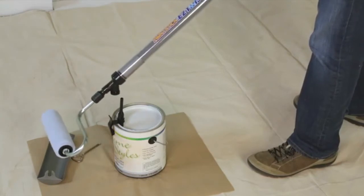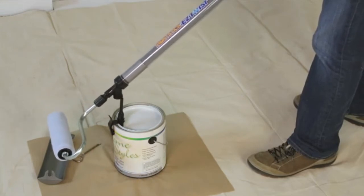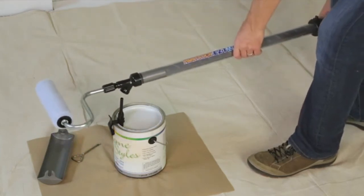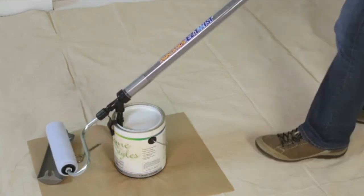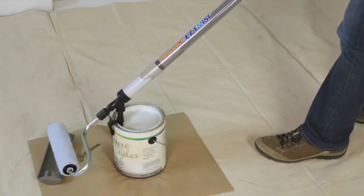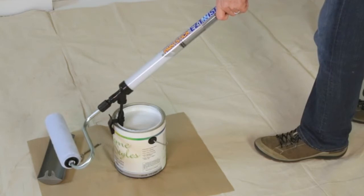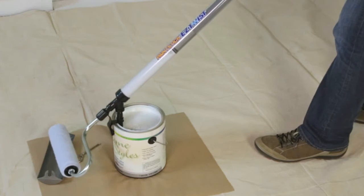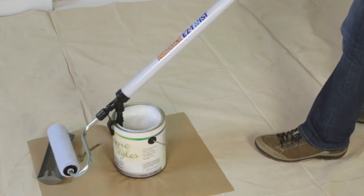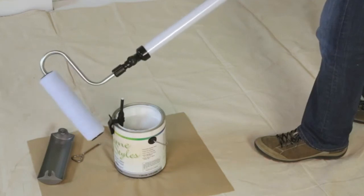To fill the paint stick, you want to make sure that the fill tube is opposite from where you're standing. Look at the angle I have the paint stick at now. This is about the right angle you'll want to come onto the fill tube. We don't want to be like this, and we don't want to be like this. So we'll put the fill port down over the fill tube, like so. Now we're going to pull back the handle, and we're going to see some air and some paint coming in. That's okay. We're going to lift it up slightly. We're going to put it back on, and now we're going to push it down. We're going to kind of purge it, get the air out of the system, push back in on the fill tube. And now when we come back, you should see a nice clean pull of paint. Next, we lift the paint stick up off of the fill tube, and the fill valve automatically closes behind it. Now we're ready to paint.